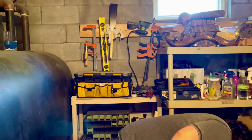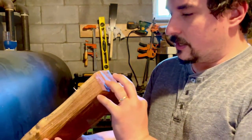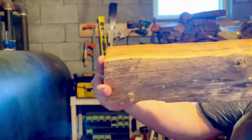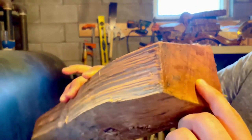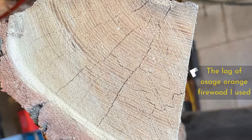I can show you what happens if you don't seal the wood. If you don't seal it, each end of the straws leaks out moisture and the ends dry faster than the center, so they shrink while the center stays more stable and you get cracks in the wood — known as checks in the industry. Firewood is seasoned, but since it's going to be set on fire, there's no real reason to seal up the ends. So checking, splitting, and warping are really common.